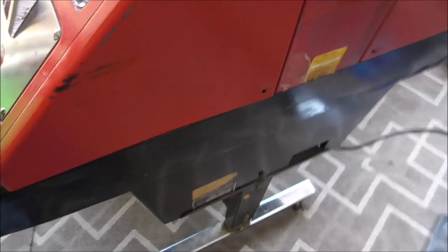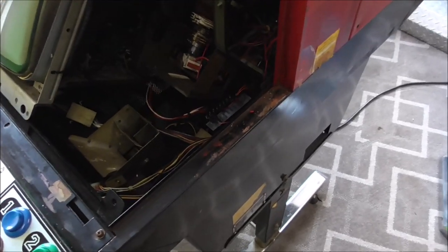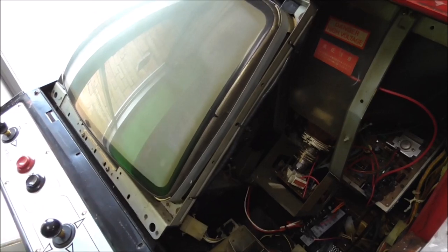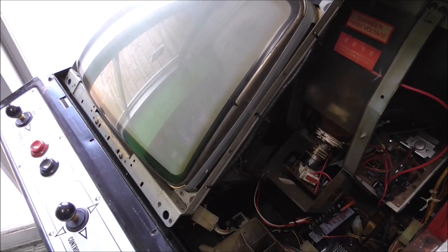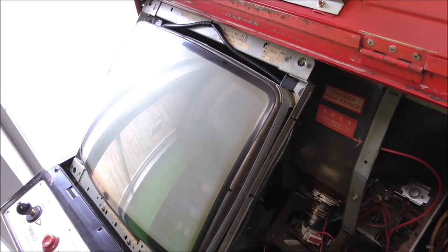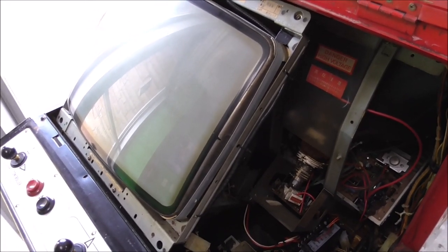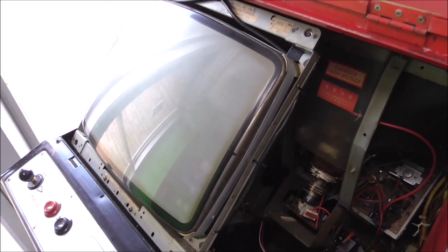What we're going to do first is take out this monitor. This is a Sharp XM-1801 monitor — there are two of them. This one is working, it just needs a cap kit. So we're going to take it out, check the caps, and see if we can get it fixed. Mike kept the bolts because he transported it without the monitors. We've got it mocked up sitting in there, but we're going to pop it back out, unplug everything, and put it on the bench.